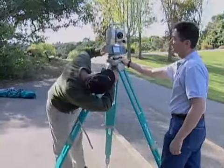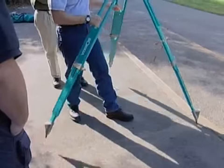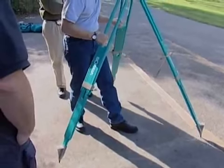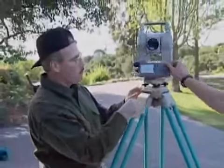There's a device called an optical plummet. You look through it, focus it to your eye, and then while you're looking at the point or somewhere near the point, you pick up 2 of the legs and manipulate the optical plummet so it's targeted directly over the point. You then have the instrument on the point but not level.